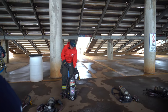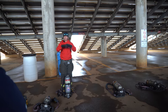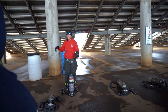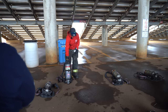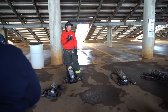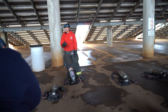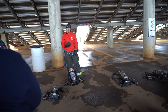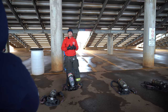It's not oxygen — it's just regular breathing air. It goes through a compressor, gets compressed down into a bottle, and goes in here. There's a device in here that takes the air from high pressure to breathing pressure that you can actually breathe. It requires a negative pressure in order to actually breathe in that air, which means you have to use your lungs and your diaphragm to draw a breath.